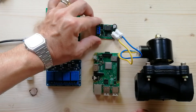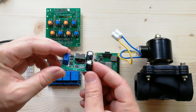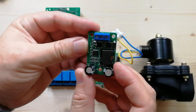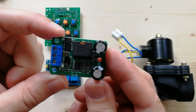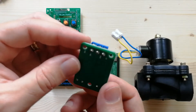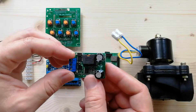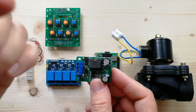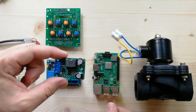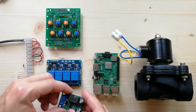Another thing: I often use a 12-volt supply because there are also quite cheap DC-to-DC voltage converters like this one, which converts from 12 volts to 5 volts. If I use a 12-volt power supply, I can use just one power supply and use this converter to supply the necessary power to the Raspberry Pi, because the Raspberry Pi works at 5 volts.